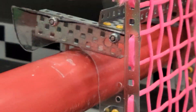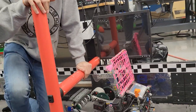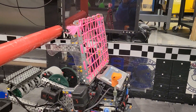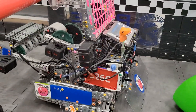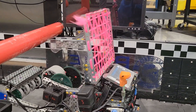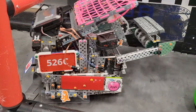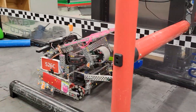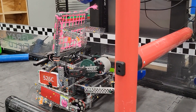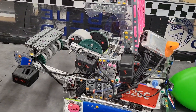It's pretty good — it gets off the ground. It's a simple just drive up. And that's the hang. Now we're moving on to the blocker. One of the things we added was this one singular motor here, so that this thing can go up and down. During Auton, we can flip the robot around, and when we bring this down, it goes under a lot better without jumping. Before, when it was up with a lot of rubber band tension, it would jump. So that was a pretty good addition, and it also helps us with blocking.